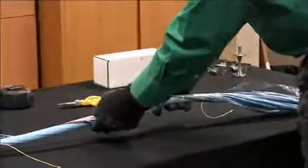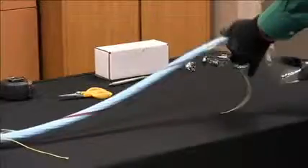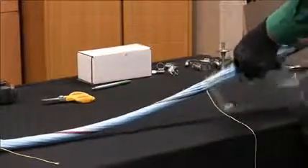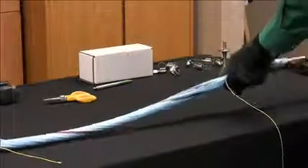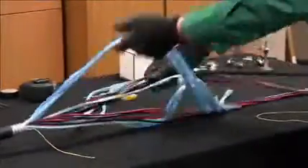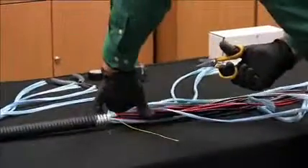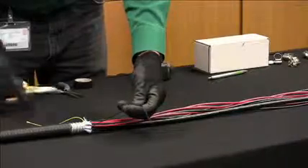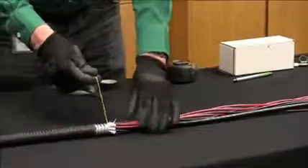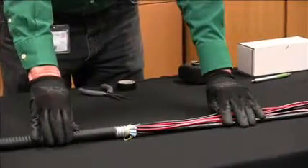Once your armor is removed, you can remove the Mylar overlay. Then separate the power cords and the blue filler so you can cut out the excess blue filler. After removing the blue filler, there's a black signature cord that you can also cut away. The tail on the ripcord can be wound around, and you can place electrical tape back over it, covering this area, and you're ready to begin your installation.